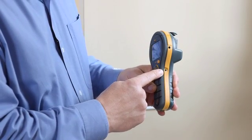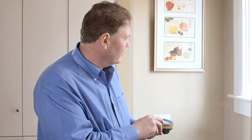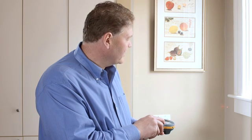One of the problems you often come across in buildings is the potential for condensation. The new MMS2 has the capability to measure the surface temperature and the humidity, and calculate a surface's proximity to dew point or condensation point. In the side here you'll see a second port where you can plug an accessory surface temperature sensor, but the MMS2 also has a built-in non-contact infrared surface temperature sensor. To turn this on, you just press this button once, and twice to get the laser pointer. You can then point it at the piece of wall or floor in question, and the reading will show not only the surface temperature, but also the surface's proximity to dew point or condensation point.